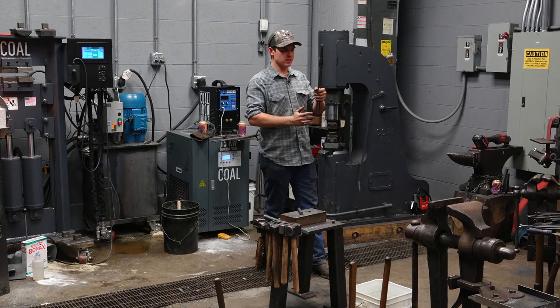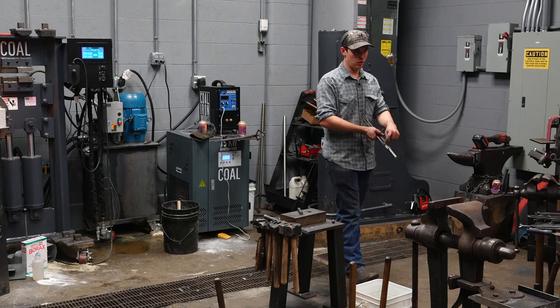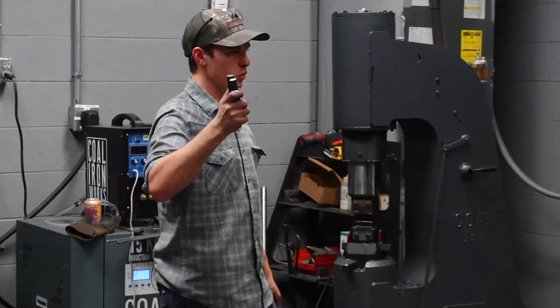If I have a forwards taper and my boss is the thinnest part right there where the rivet goes, they're gonna bend there over time, or maybe immediately they'll bend there. So I want everything to taper behind, everything in front to taper forward. This is 3/4 inch round mild steel by 4.5 inches long. I'm gonna demonstrate how I make tongs normally.